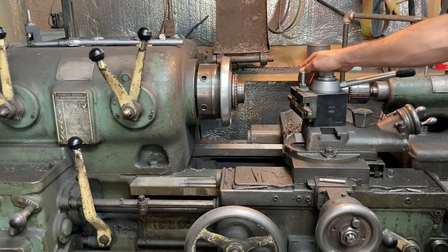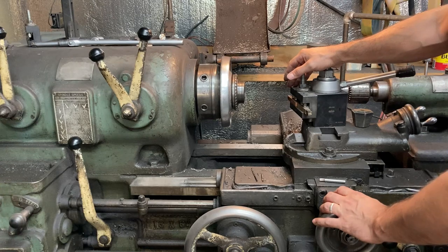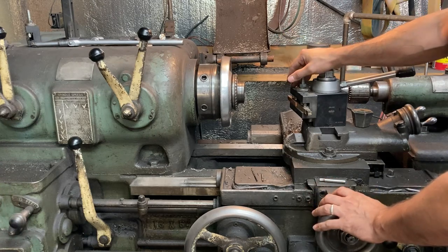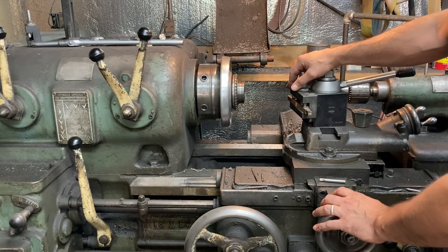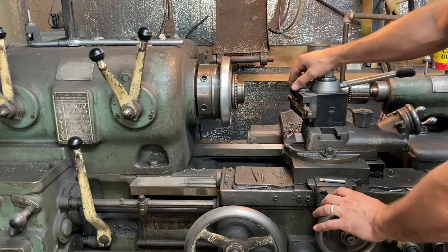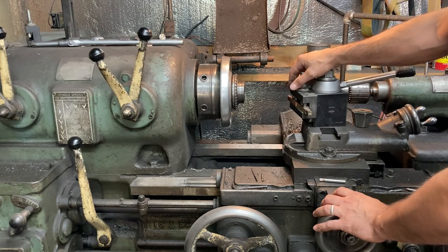If you keep watching my channel over time, you're going to notice that whenever I use this lathe, I'm gonna crow about it a little bit. This is one of the pride and joys of my shop. A 1953 Pratt & Whitney Model C 16-inch tool room lathe, actual swing 18 inches, 7.5 horse three-phase, 1,000 RPM top speed, everything in good working order.